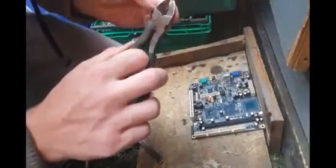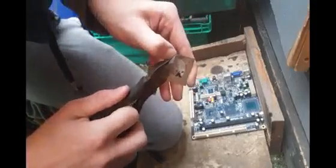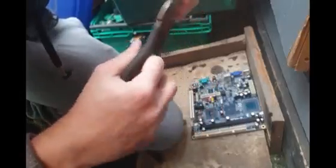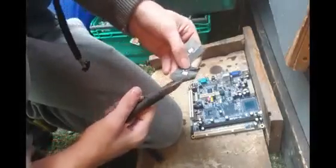That's all you do. Metal cap. Peel that. It's undone. And just kind of drag it away. These yield really good. If they have a silicon die on the top, which is like a little glass piece on the top, then it's a flip chip and they won't contain this black epoxy on the bottom. This one will not have that because it has the black epoxy.